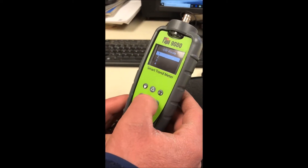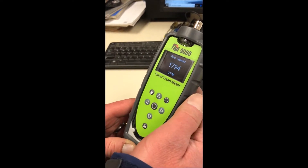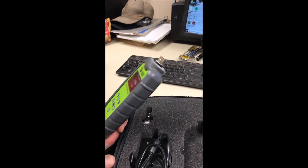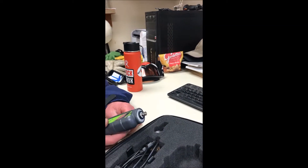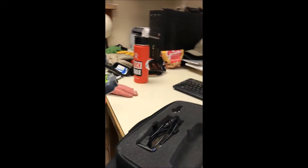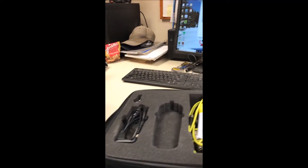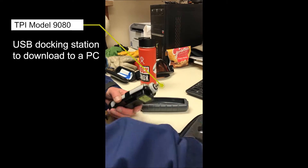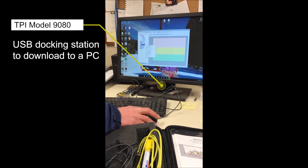If I click on this off-route one here, it gives me the option to change the run speed. I've been doing them all at 1794 RPM because that's a pretty typical RPM for a motor. Was it pretty easy to set up? Yeah, I spent about an hour reading through the manual and then just went out and started playing with it — it's a lot less complicated than I thought it might be. It's really user-friendly. To download your readings, you pop it out of the case, slide it into this cradle, and USB it right into the computer. You just click 'from meter' and it'll download.